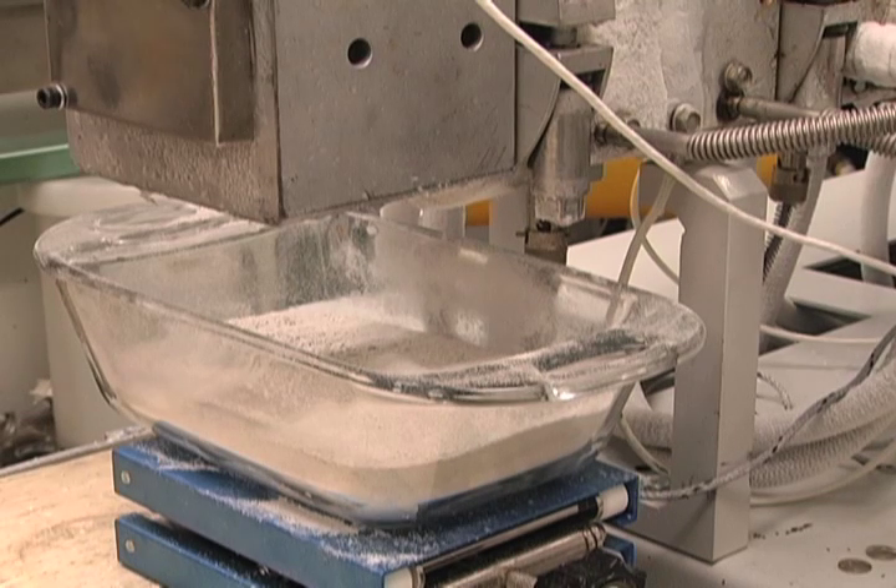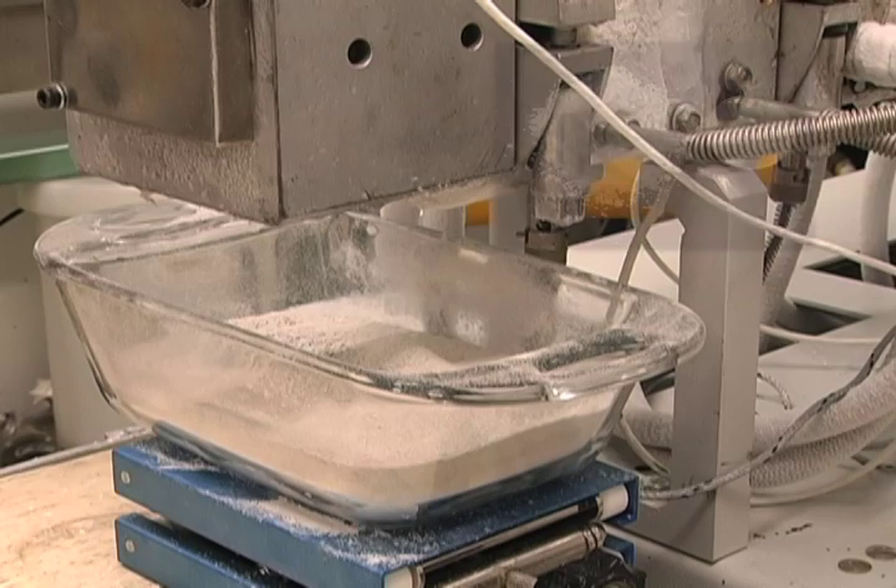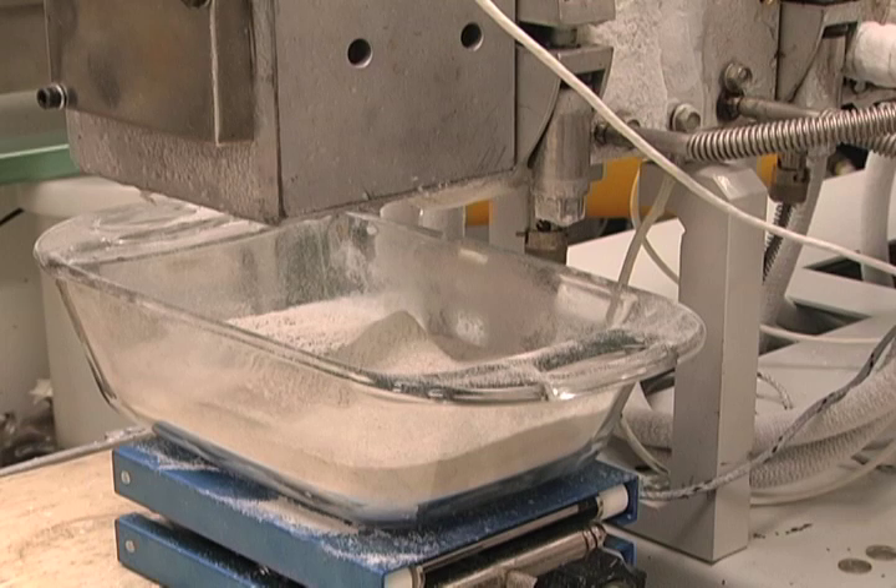The physical output of the SSSP process is in the form of fine powder or small flakes, and the product can be molded into appropriate test specimens or products by applying short-term melt processes.